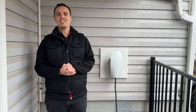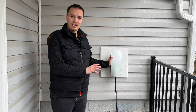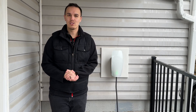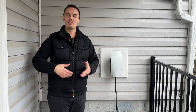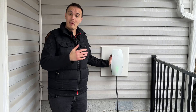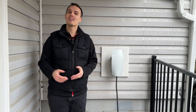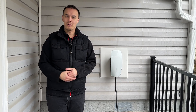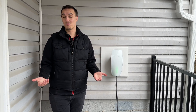The last two pros are pretty significant. Not everybody has a home setup to max out the Universal Wall Connector's power, which can reach 48 amps or about 11.5 kilowatts. For our install we maxed it out with a 200 amp panel, but what's really cool is that you can be flexible with power output depending on your setup. You can dial it back to 32 amps for 7 kilowatts, go up to 40 amps for around 9–10 kilowatts, or max out at 48 amps. We really love how flexible it is for both install and usability.